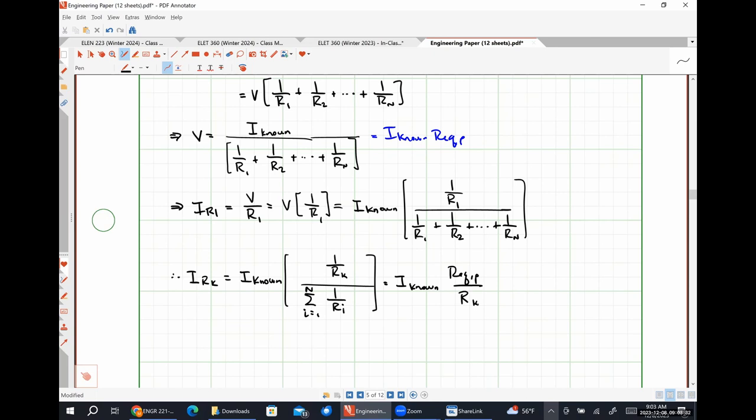So we have another situation where we can define currents without ever solving for a voltage, right? Everything is expressed in terms of ratios of resistances, but with current division, we wind up having to deal with the reciprocals. Now, that's potentially very different from what, if you've taken this class before with somebody else, they might have shown you, a very different relationship, and we're going to get to that relationship here in just a moment, okay?